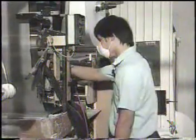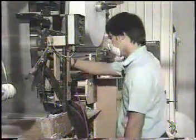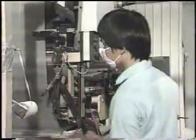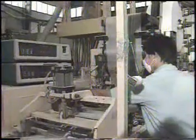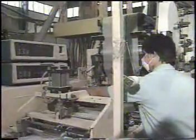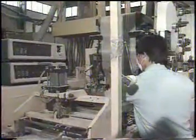The elastic bands are on both sides of the PE film and controlled by PLC. They are sprayed with an appropriated hot adhesive and adhere together with the PE film. This will help prevent leakage on the sides. If the elastic bands break for whatever reason during the process, the electronic monitor will detect it, stop the process, and wait for workers to handle it.